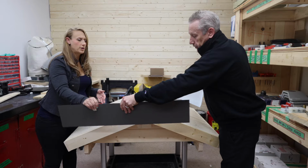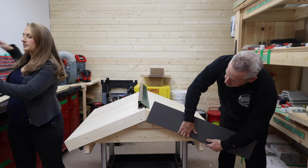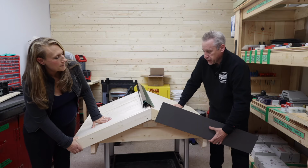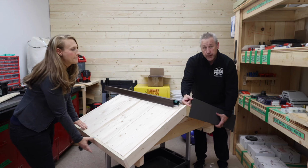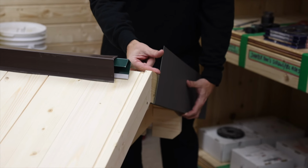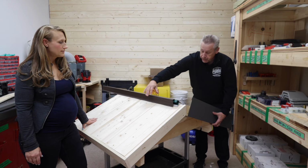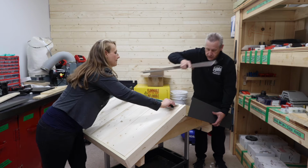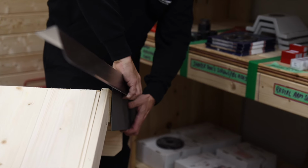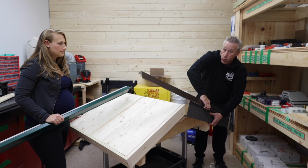Here, I'll take the extra one. Thank you. So when you're putting it together, basically it sits right on the bottom edge and comes up over top. Now what you see here, if you turn this sideways a little bit, there's quite a large gap in here. I just made one for the art of this particular presentation, but I would adjust it to fit where it doesn't get past your actual straps, and then the other piece comes over top, which can look multiple different ways. This is one we'll use with the flying gable in a second. It comes down from on top and then covers the edge, making it a fully solidly cladded area. So there's no seam or area at all where wood can be exposed.